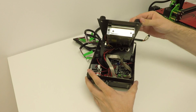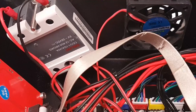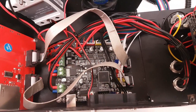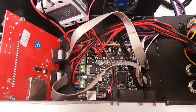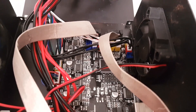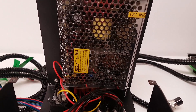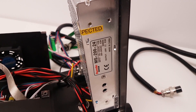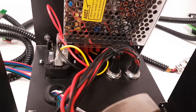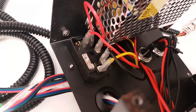And now let's see what is inside the control box. There is an AC relay next to the case fan which will heat up the glass bed very fast because it runs on AC power instead of DC like on other 3D printers. The power supply for the rest of the components is 24V, 8.5A, silent type. The control box fans are connected to the temperature sensor so they only spin depending on load and temperature, which is great. And all the wires are nicely isolated — no problem.